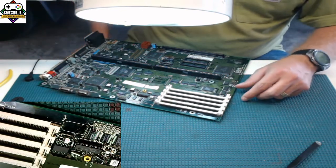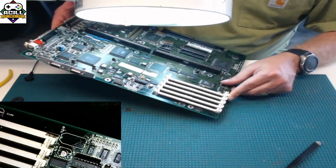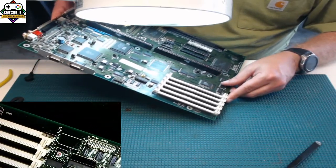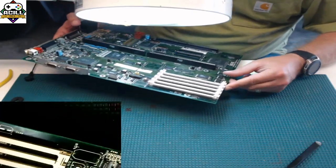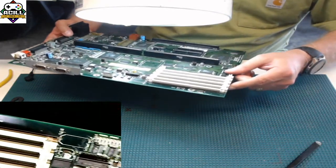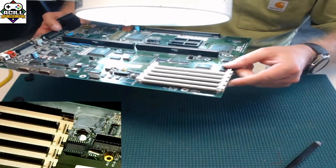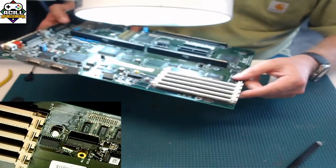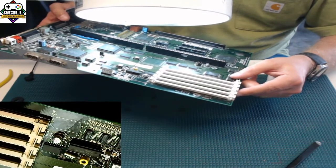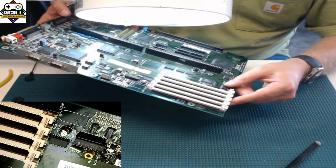All right, so there you go. If I lift this up, you can see nice, clean, super simple solder joints. Looks factory. It's a happy chip. And I don't know if you can see as well as I can in this. I can bring it up closer to the microscope so you can in fact see it. And there you go. You can see the difference between the two sides. Personally, I think the drag solder side is a much nicer looking set of joints than the side that I pointed.